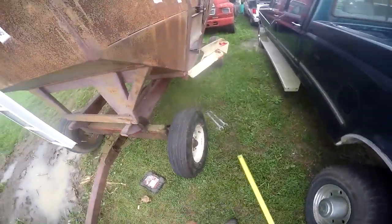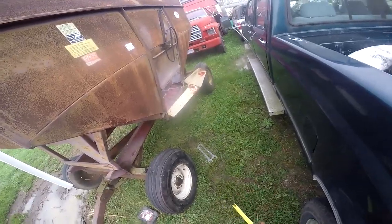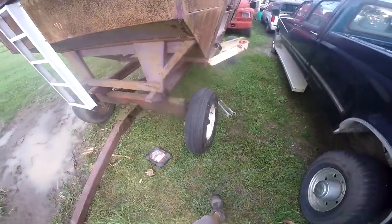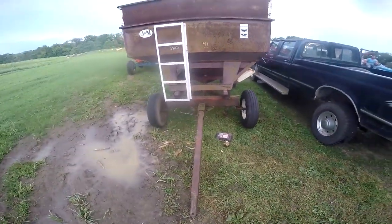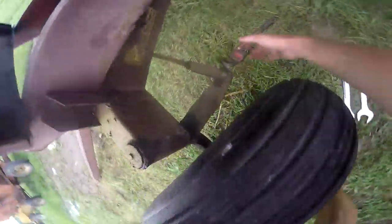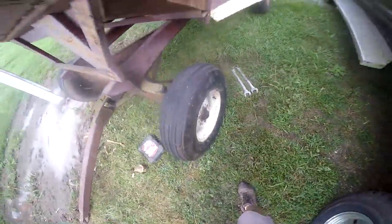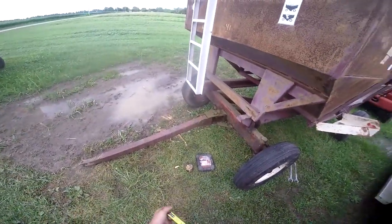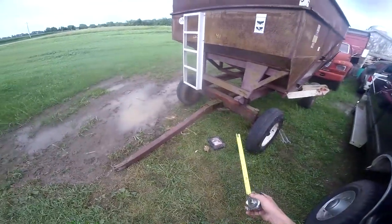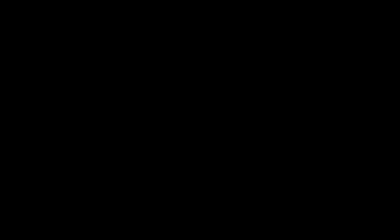Unfortunately, the spare we have is 15 versus 14 — it's a little narrower. But just by eyeballing it and measuring, we are correct. Now, to tighten it up, put the nut on the bottom and jam the jam nut tight. This has been a quick educational video. Remember: keep your toe-in to a quarter inch or less, and match your front and back measurements. We'll catch you guys later with more fun farming adventures.